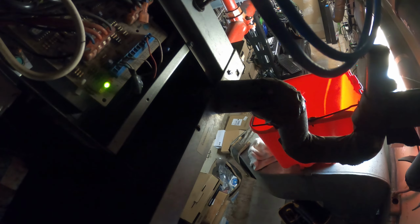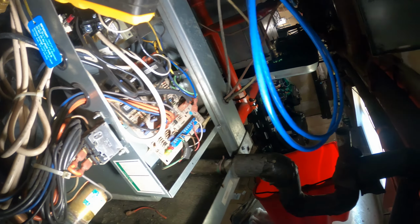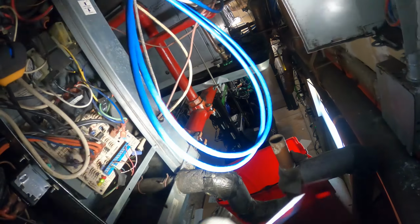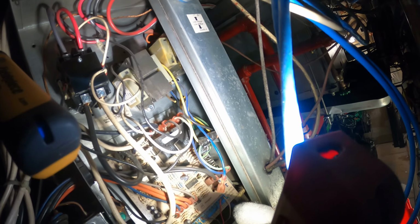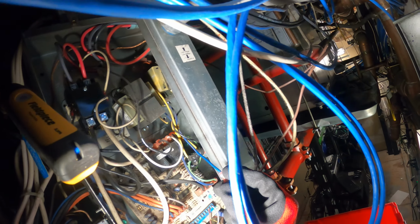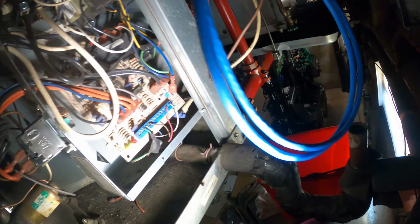But of course we can see something is strange here. We have a light indicating that we have low voltage. I've done a service call in this building before in this area, and I did notice that unit right there with the wet switch, I have a video on that. Even with the pull switch off, I still had 24 volts here, and the transformer inside there was disconnected. There's 2 transformers in here. This one's disconnected. Oh man, well, let's see what's going on.